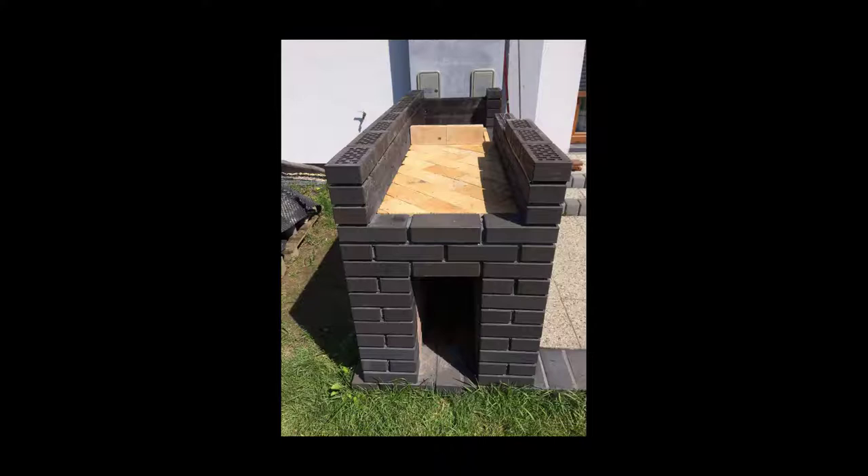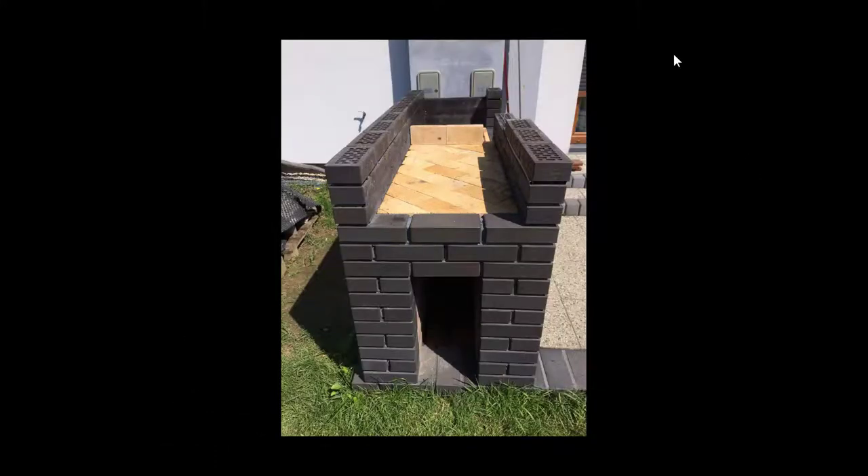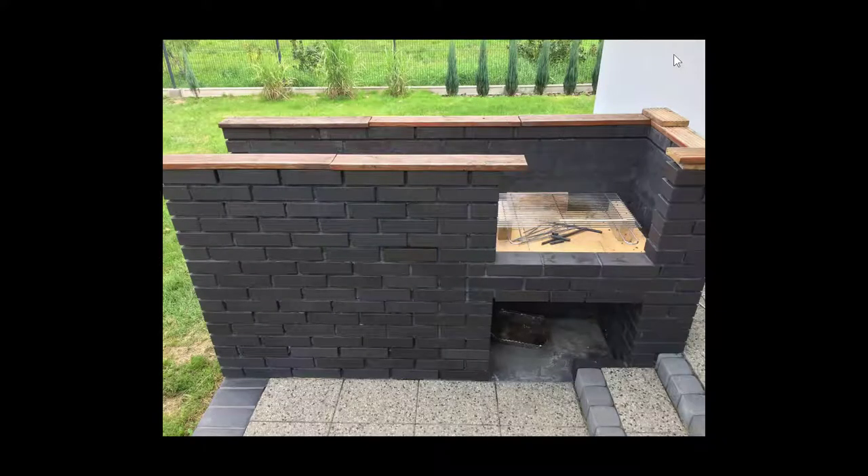This is the state after the concrete has dried. I started to build the side walls and also put an extra layer of special bricks that are resistant for high temperatures. I built these up to about five bricks, and in the meantime I was trying to plan the oven. The same was done in the grill area, where we can see the extra layer of thermo-resistant bricks.